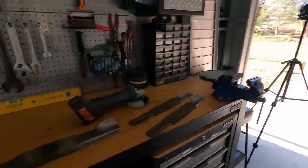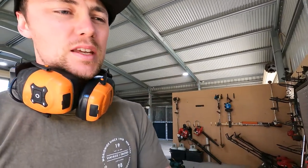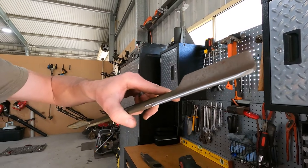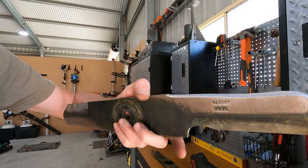I feel like the video doesn't need to continue showing that process that many times. So hopefully I can explain it as quick as I can. I know someone else can do it quicker, but here's my analogy of it all. My process: hit the top, you would have seen across the top, follow the angle of the blade, okay? Come through underneath. That's all by feel, and that is good enough for what I do. You can get it even better, but all in all, that's a quick sharpen.